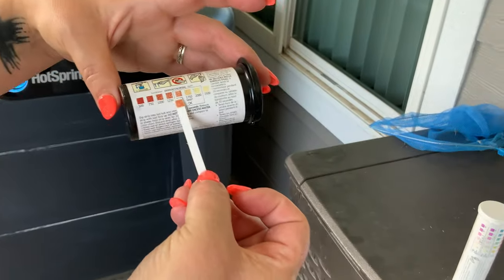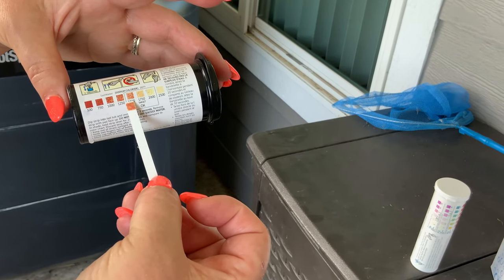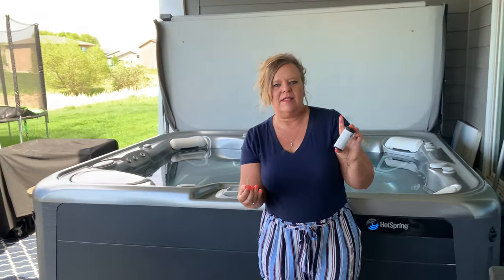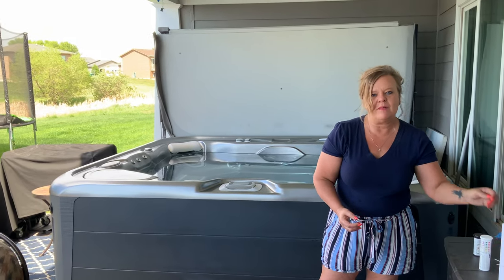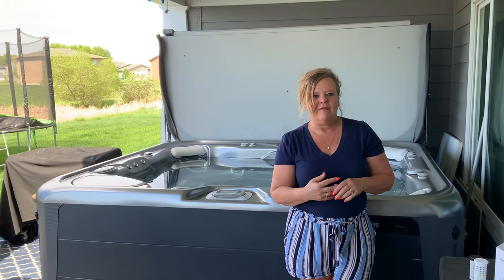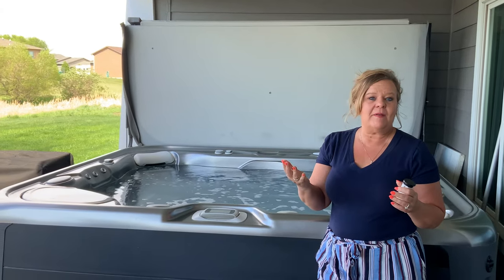After about 20 seconds, we line this up — and I'm actually a little bit low. So I'm going to start by adding just one more cup of salt and see if that fires it up. Reality is, I know I'm going to end up having to change my salt cell because it's very overdue, but we'll test again and make sure we're at 1750 before we change that cell.